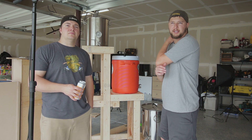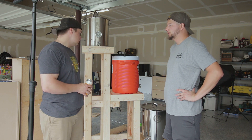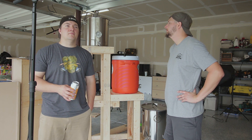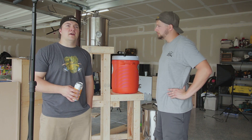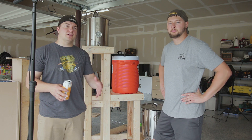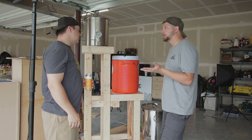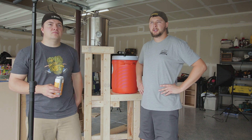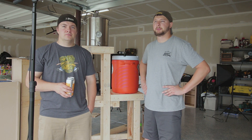For about a hundred bucks you can build your own three-tier brew stand. It's mostly out of two-by-fours for the base and frame, one-by-twos to hold the slats, and one-by-fours for the slats — the actual table portion. You could also get away with just a piece of plywood for the top. The most expensive part was the wheels. We did all-four rotating and locking wheels, but you could save money on non-rotating or non-locking wheels, or just not getting wheels at all.